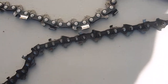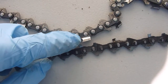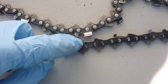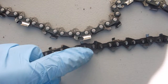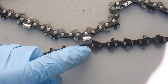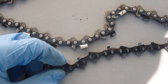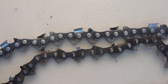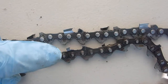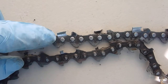Moving on to the next chain. I want to point out the difference between a chain that's almost worn out and a chain that's almost brand new. See how much this tooth has been ground back? Quite a ways — this chain is ready to retire. Got one more sharpening and then we'll just throw it away. I'm going to use this chain today to cut through brush, and this one I'll use for cutting down trees. You can see how much smaller this tooth is than that one — this chain is almost worn out, this one's almost brand new.